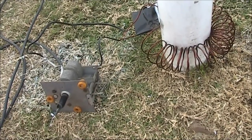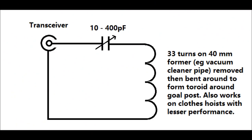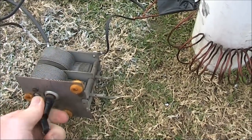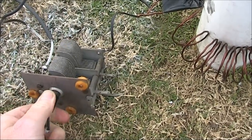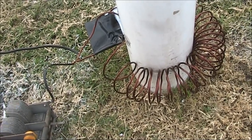I've got no direct physical connection to the goal post. Instead, it goes through a toroid that I've made of stiff wire. In line with the coil is this variable capacitor. There's a clear resonance in about the middle of its position on 7 megahertz — probably about 200 picofarads capacitance at the moment. There's no connection to earth.